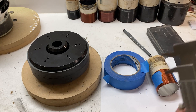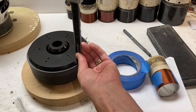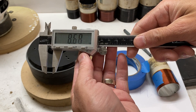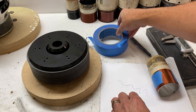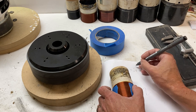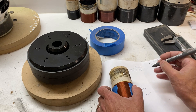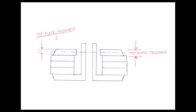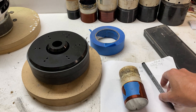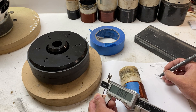The next thing we're going to do is unlock the calipers and measure how thick the top plate is. I'm getting 8.68 millimeters. So once again we divide that by two: 8.68 divided by 2 is 4.34 millimeters. We can either just note 4.34, or add 4.34 to 22.875, which is what I'm going to do in this particular case.